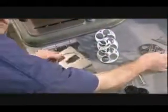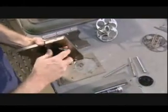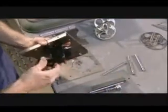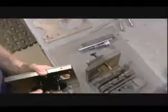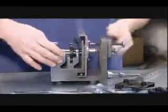Now they assemble the change machine's coin dispenser. It has two counter-rotating discs fitted to the diameter and thickness of a coin. They work together to seize and align the coins, then drop the change into the coin chute. Workers set in these metal discs and a plastic gear mechanism that rotates them.